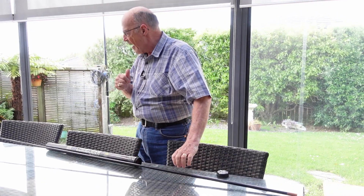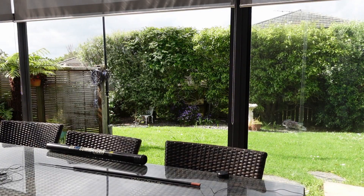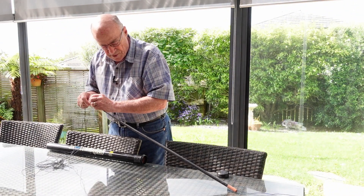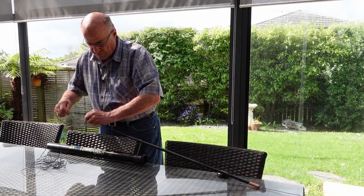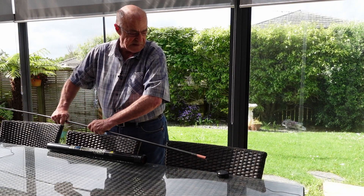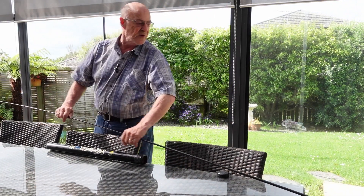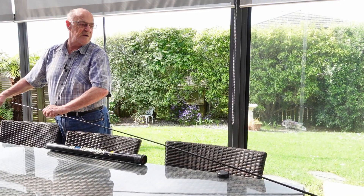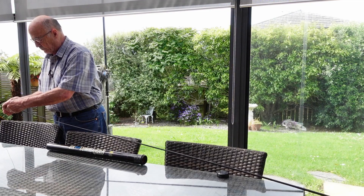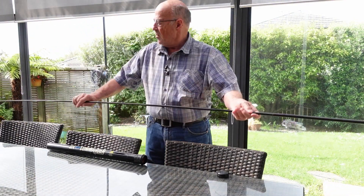Just bear with me a moment and we'll go grab some wire. Okay, I'm back again. I've just grabbed some DX10. Now that threads neatly down the centre of the smallest element. Once we've got that threaded down — just pull out the elements again. So what we're doing is threading two and a half metres of DX10 up the middle of this outfit here. And that makes us half of our dipole. I've got plenty of wire down that end there. So I put a knot in here just so it won't pull back — now that I've threaded it in, I don't want it all pulled back. One half of my dipole.